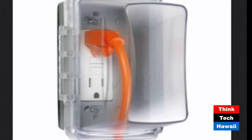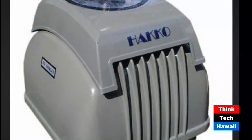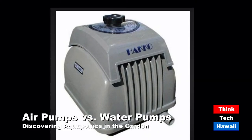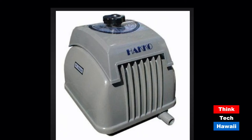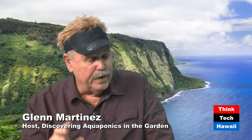We use little air compressor pumps. Hako is one of our favorite brands - very quiet, available everywhere. Another brand is Metella. They hum so quietly we put them in classrooms with no complaints. The only complaint was teachers asking for an indicator light so they can see from across the room that it's running. A lot of our airlift pumps use clear pipes so you can see the water going up and down. You don't hear the pump, but you can hear the water running - just like a waterfall. With submersible pumps, you have no visual indication the water is being pumped until you have dead fish.